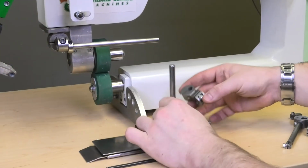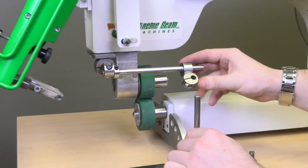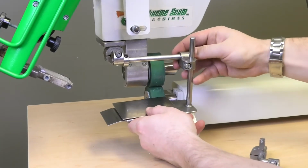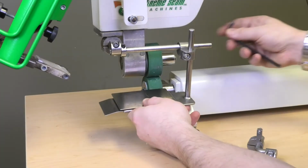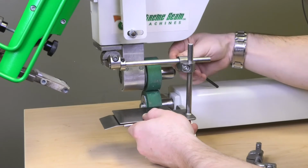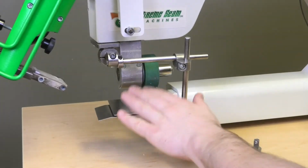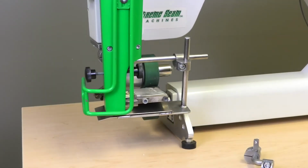After we have this on, we're going to grab our panel and then our welded together collars. We're going to slide these on like this. And this edge of this panel you're going to want about right there, right against the edge there. So once in this position, we can level it out. Now, just like the other guides, we might have to make an adjustment later on. I'm going to swing our wedge in just to make sure we don't make contact. And that's looking pretty good.